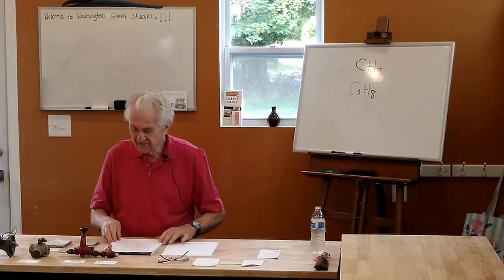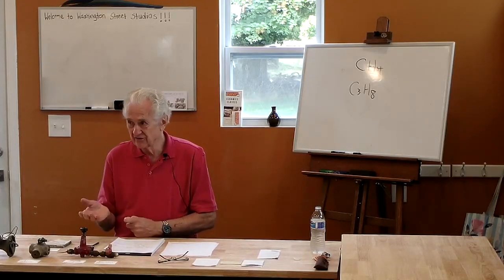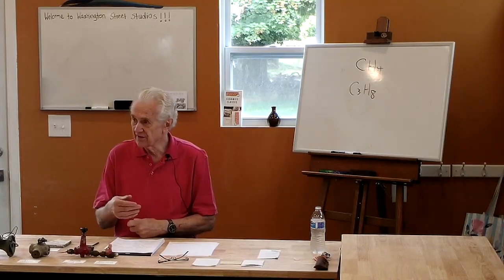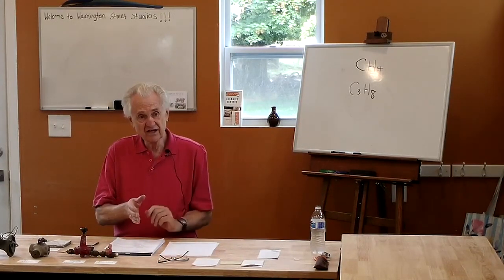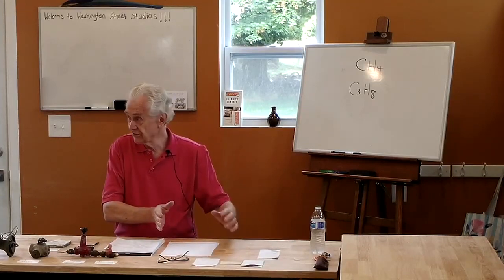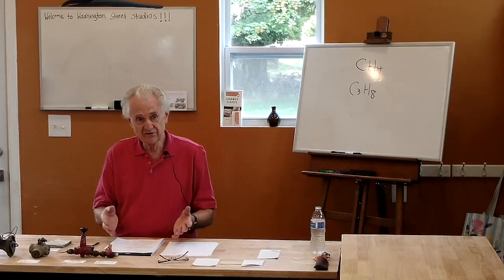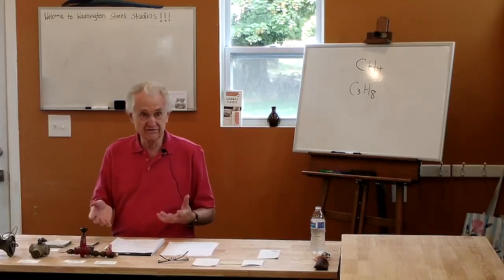With propane, I've had propane in a lot of different locations. There's generally no permit required. Some cities will require it, but generally not. And so what you do is you work with the propane company to get a safe installation. They have guidelines and regulations, depending on the size of the tank, you're only allowed to put that within a certain distance of an ignition source or a spark. And so they have guidelines that they follow. And so you work generally with the propane supplier in terms of ensuring that your setup is safe, but there isn't any sort of government involvement.